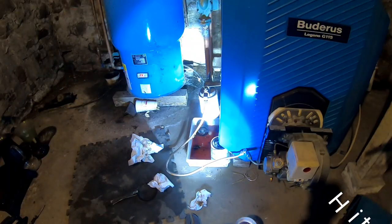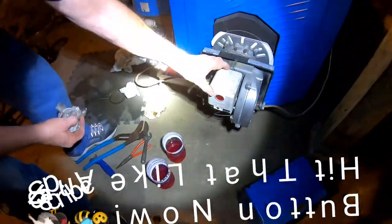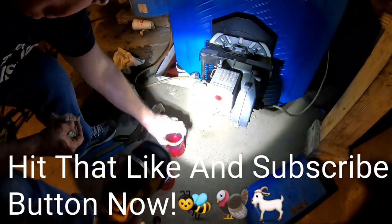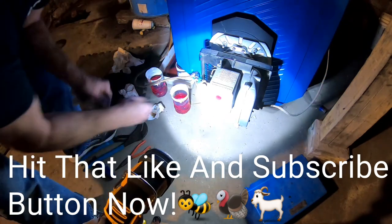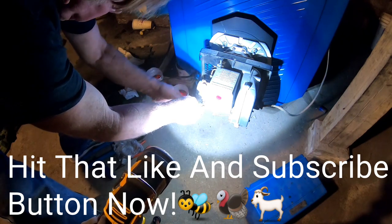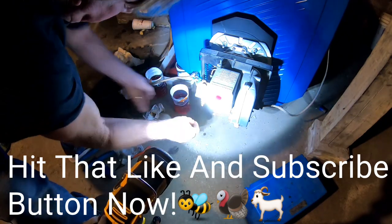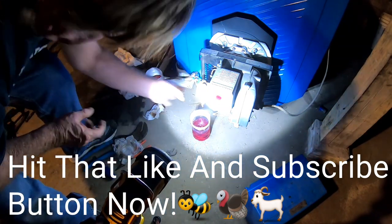For bleeding, you bleed it here — he's already bled it. We don't want to kick these over. That just gets the air out. What you do is you loosen this up. These are already loose. All right, we've got oil to the burner, so we know we have oil getting through.